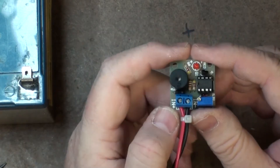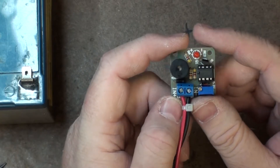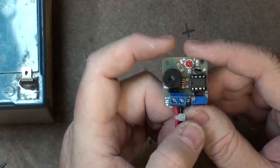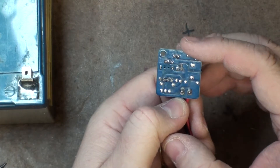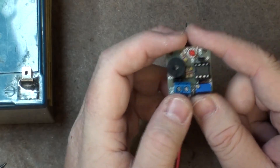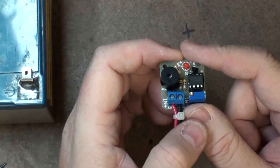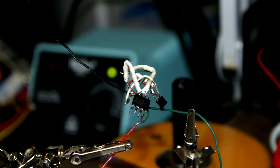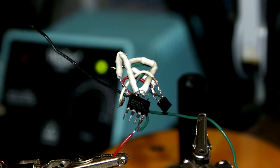There's not much to this — it's a common circuit. In fact, they may have even taken it from a blog I have, because I have made two of these. One of them is in a Makita drill that I converted to lipo. Instead of using a circuit board, I did it as what they call dead bug, where I just turned the chip upside down and soldered everything to it, and then potted it. If I can find the picture or part of the video, I'll include it in this one.